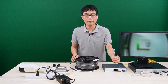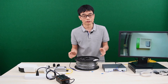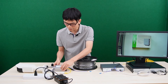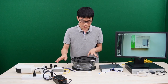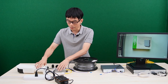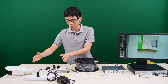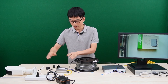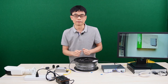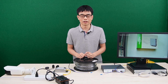I'm using a pre-made fiber optic cable, so I don't need to make the connector — everything is built in the factory, simply plug and play. The last component is the outdoor-type media converter, which also supports PoE. So it not only converts the fiber optic signal to electric signal, it also supplies PoE power to the camera. From the camera to this media converter, we can still have up to 328 feet, so if the power source is not very close to your camera, we can place this outdoor media converter a bit farther from the camera. That's all for today's video — if you have any questions, please post them in the comment section below.